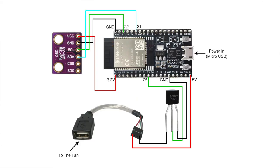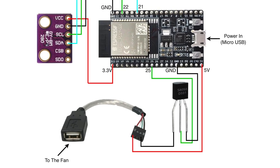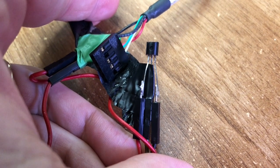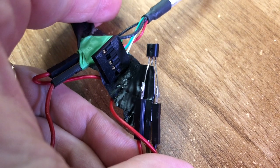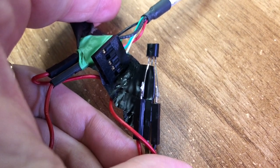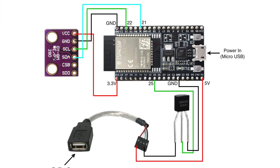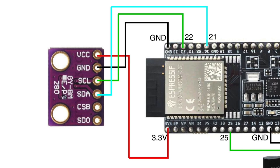You can't just connect your USB fan straight to your microcontroller. At this point I think I'd better just show you the wiring diagram — it's a lot easier to show you how this connects together than explain it. You need to stick a little NPN transistor on the ground wire first. I've soldered mine in place to make it nice and compact but you can just use DuPont cables and lots of electrical insulation tape.